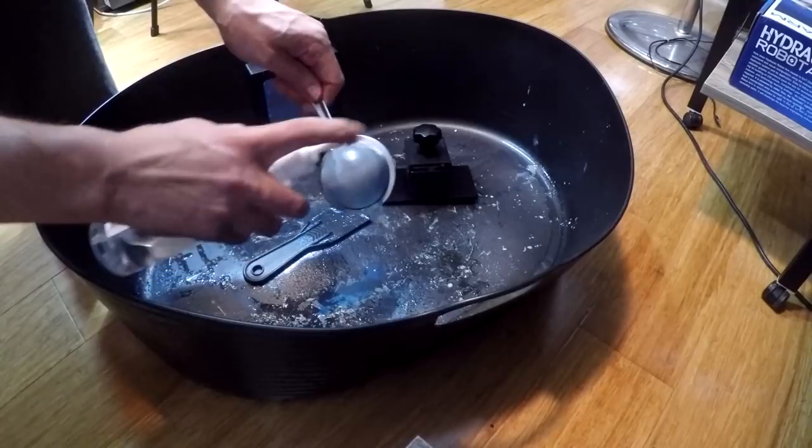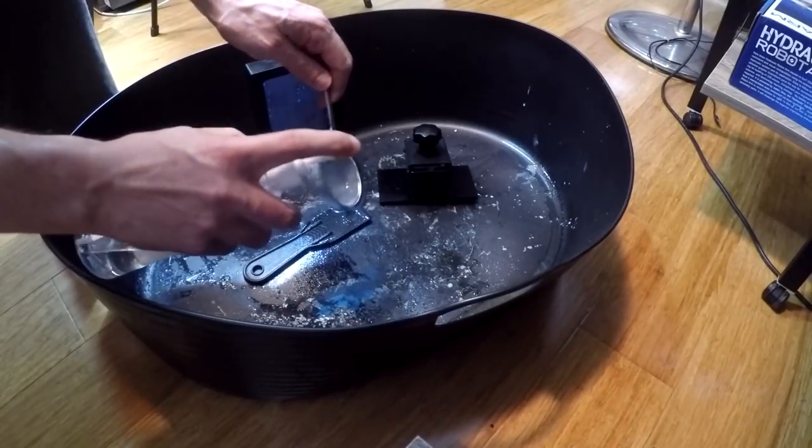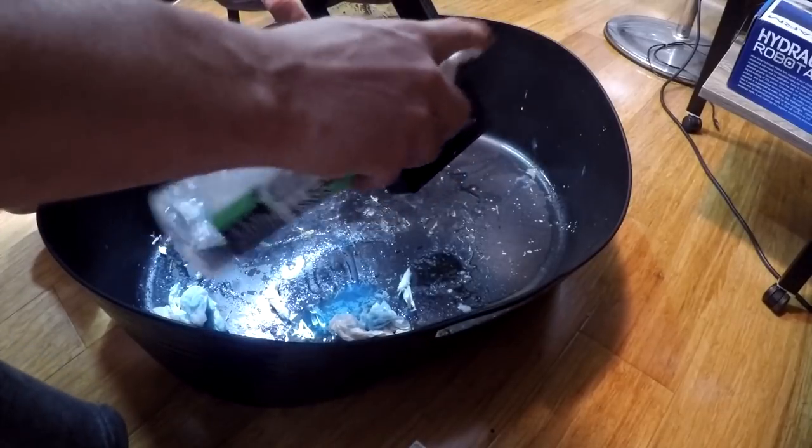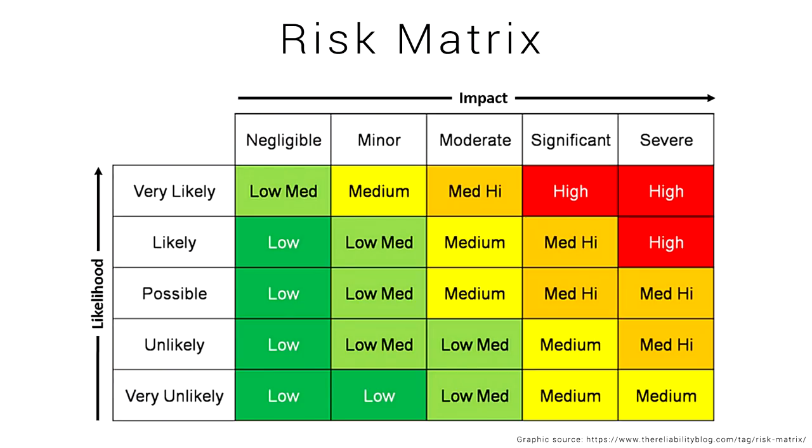What is possibly hazardous, however, is cleaning the vat. In this instance there's much more chance of the IPA touching my fingers, although I think with the technique I showed, generally I was holding the clean end of something at most stages. You could definitely make a case for wearing gloves if you were cleaning out the vat. Personally, I find I'm only doing that job once every couple of months, so my exposure is very small and I have no reactions — so I'm happy to keep doing it the way I have been.